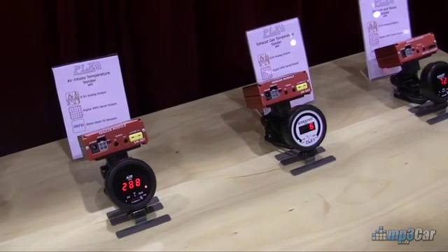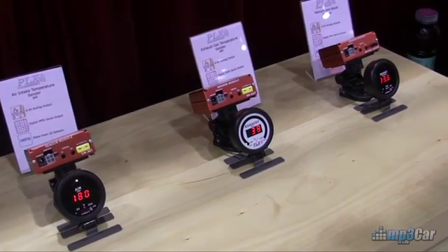What's neat about our sensor modules is that you can daisy chain up to 32 boxes — multiples of the same one or different varieties. You can mix and match any combination you want, so you can always expand the setup. It's streaming out at 19200 baud, and you can feed this directly into your PC via USB or RS-232 to create applications. All your sensor data comes in at a rate of 10 hertz — 10 times per second — consistently.